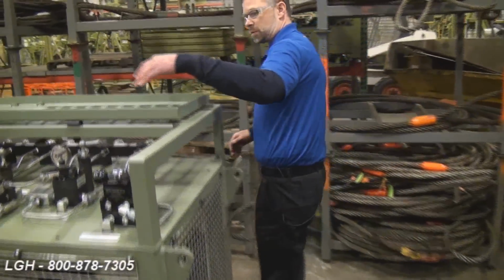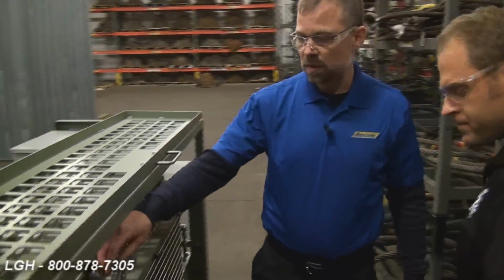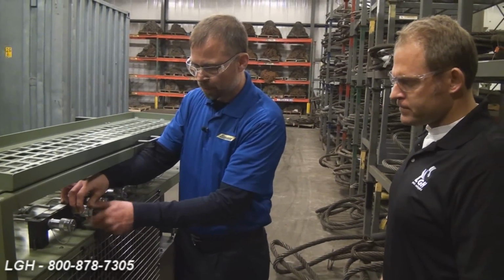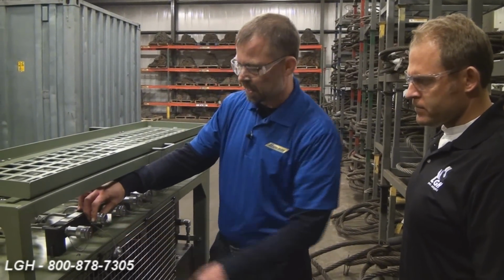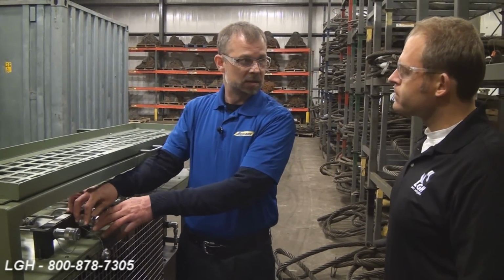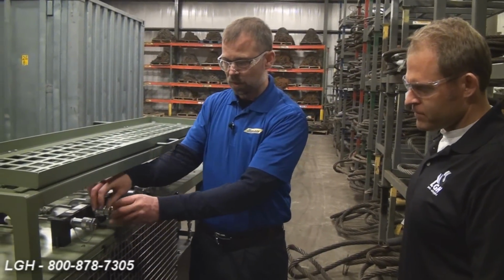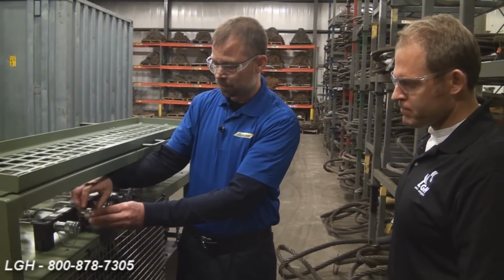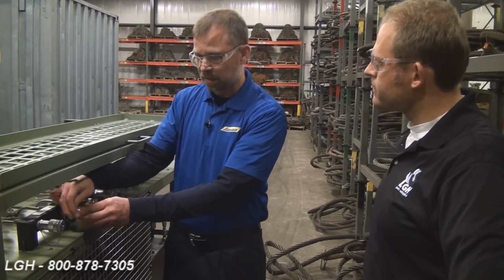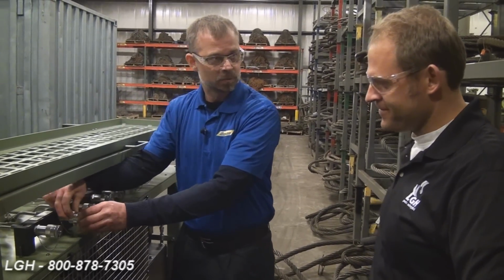Once the oil flow goes through the circuit, it then comes to the back and goes out the ports. The ports are quick connect couplers, and each port has a dust protection cap. The cap should remain on at all times. This prevents debris from getting into your oil, and it also acts as a safety so that nothing can project out under pressure from the back end of the unit. Because of that probability of something coming out of the back end, we recommend that no one stay behind the pump during operation when it's on.